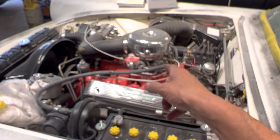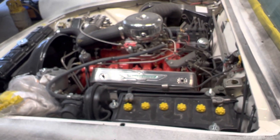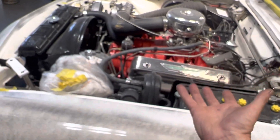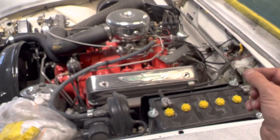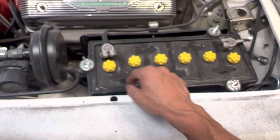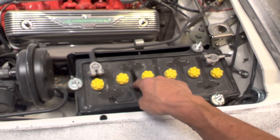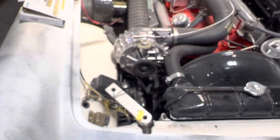You have to tweak it though — since you're delivering more air it would run too lean and you'd burn the valves. You have to open up your ports and metering for more fuel delivery to compensate for more air delivery, to keep your fuel-to-air ratio correct. That's a very simple, cheap, basic way of getting a little more horsepower. Of course it's nicer with injectors where you can dial in your pulse rate based on load and RPM, and dial in your timing curve and dwell — but then you're getting into computers. Simple, old, basic. Look at the old-style battery — it's a new one, but done in the old style. Back in the day they used to pour tar in the tops of old batteries — that's how handmade batteries were made. Alright, I'll catch you guys later.